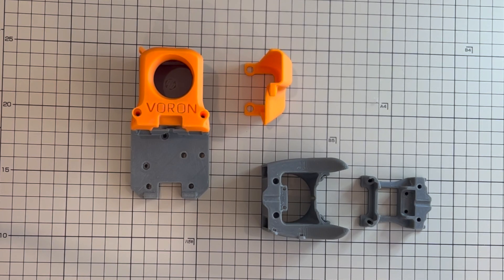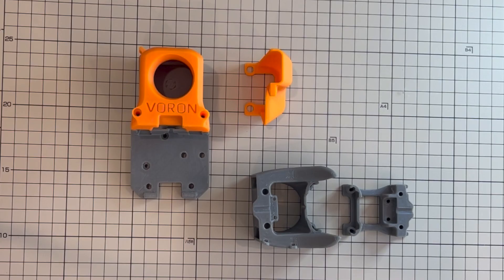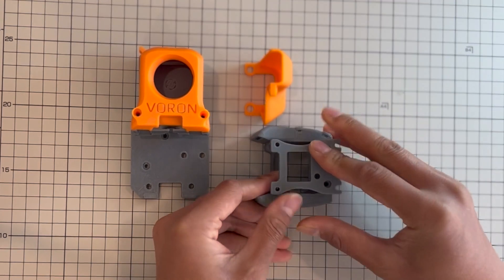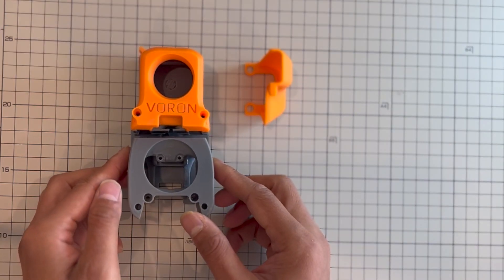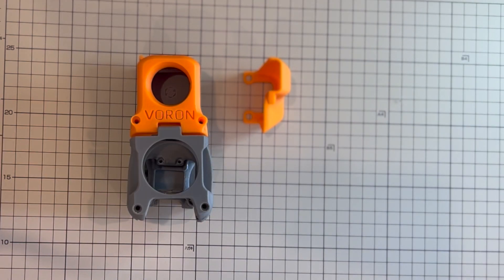The fourth one is the hotend mount. You need to print this one for mounting your stock hotend. You will need these two models from Thingiverse. If you are using an Afterburner-compatible hotend, you can print this one from the official Afterburner GitHub repository. This is originally designed for the Ender 5, but you can still use it for Ender 3 version 2 because both printers come equipped with a standard Creality hotend. You mount your hotend here, install the cover, then install it onto the plate. If you have a BL Touch like me, you will need to print a mount for it as well. Again, you can find all the links for the models you need to print in the description of the video.